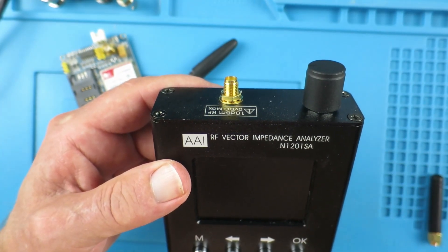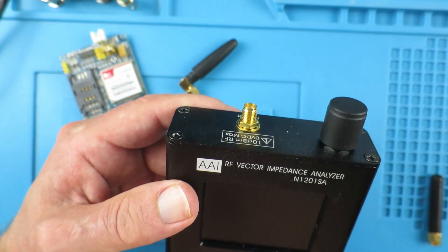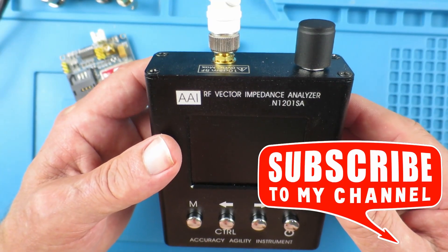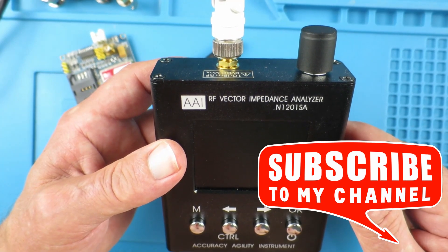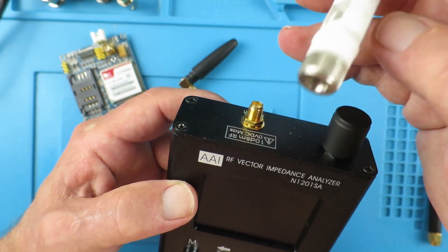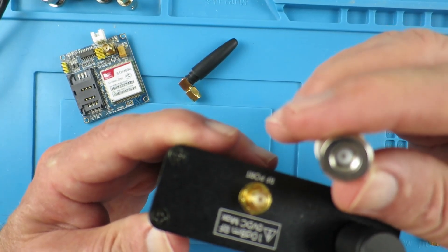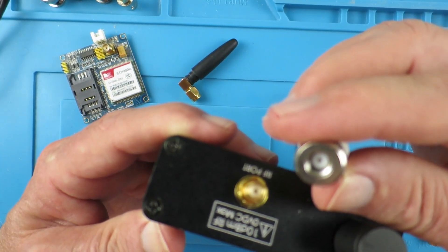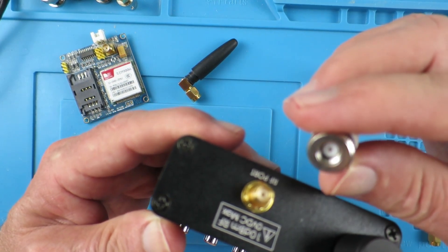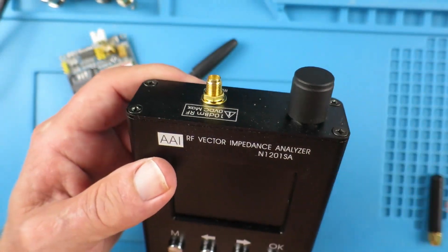Well, that doesn't always work out. In my excitement to test my new toy, I just grabbed an antenna and screwed it on. I was surprised to find a completely flat line - no signal, no graph being displayed for the antenna. The problem is that this is SMA and this is reverse-polarized, so it's a socket and a socket, and that is not going to work. People have been known to bodge this by putting a piece of copper wire in the center, but that's not really the way to go.